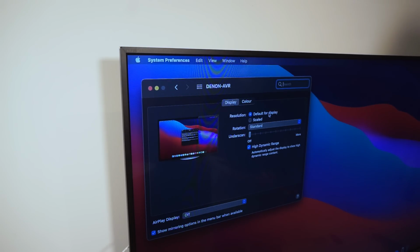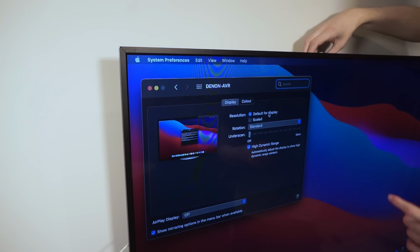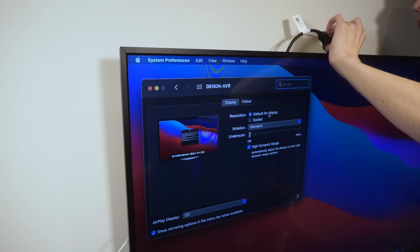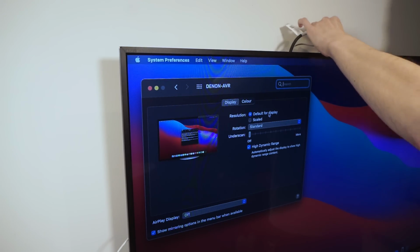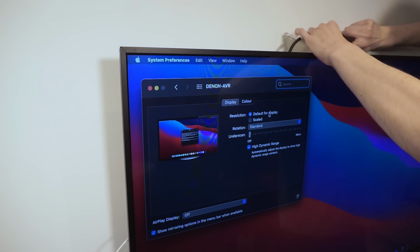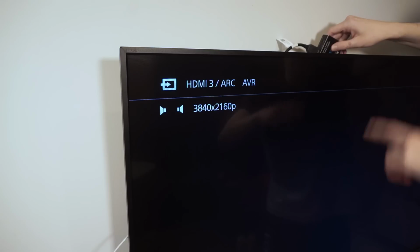Now let's change those dip switches. So the first one I'm going to do is just the EDID emulation. On this, most of the modes are all 4K, but there's one 1080p mode. So if I enable that 1080p mode on this, which is by setting dip switch 5 to the off position, this will now emulate a 1080p screen instead of the screen that's actually a 4K screen. So we switch that dip switch, which is very fiddly to do. There we go. The TV cuts out.